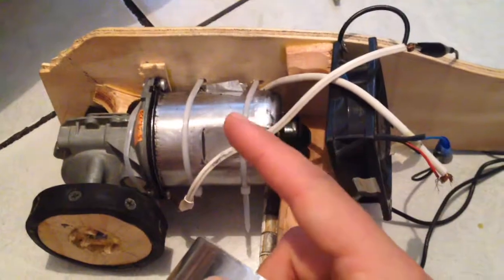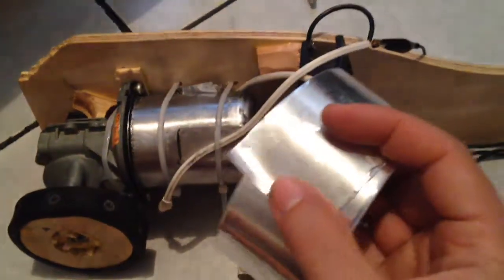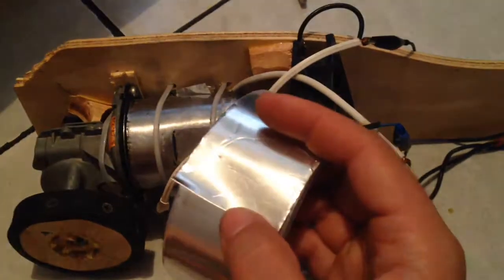When you're doing this, you have to use the metal tape — tape that is thermally conductive. If you use normal duct tape or something like that, it's plastic so it will actually insulate the motor and the heat will not be conducted through. This is like tin foil, so it's aluminum and the heat conductivity is very high. It's easiest to bend the shape of your fin with the paper backing still on so it doesn't stick to itself, and then after you can peel it off, stick the two sides together, and stick the foot onto the motor.